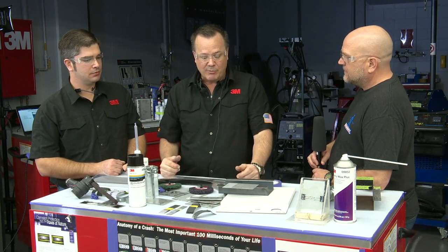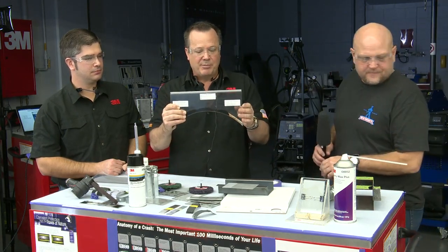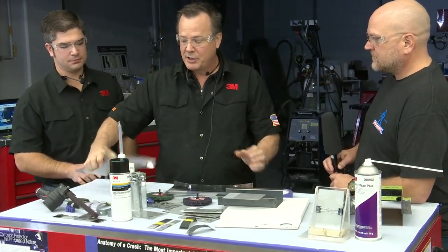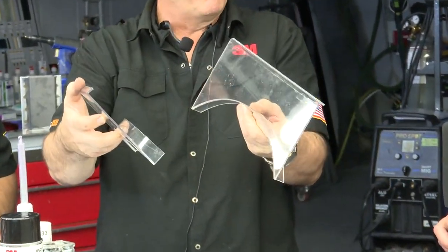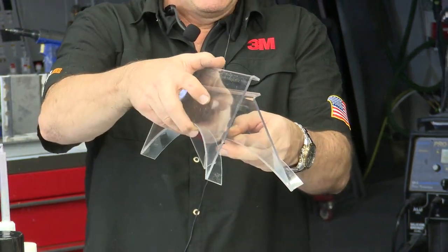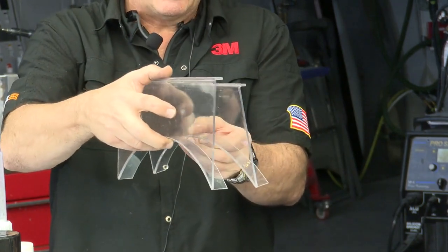As long as we're talking about squeeze out, I want to mention one other thing. This is a good example of, let's say, a quarter panel. So this is 2, sorry Dan, but 2 panels that are put together, right? So you put your adhesive on both flanges, like we just talked about, and then we put our squeeze out bead, and then we put these together. Well, there's a couple things. Number one, you technicians out there know what I'm talking about.